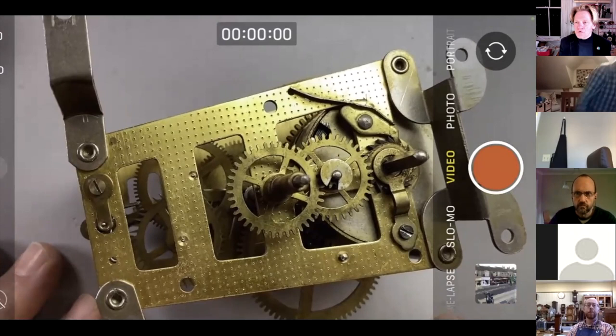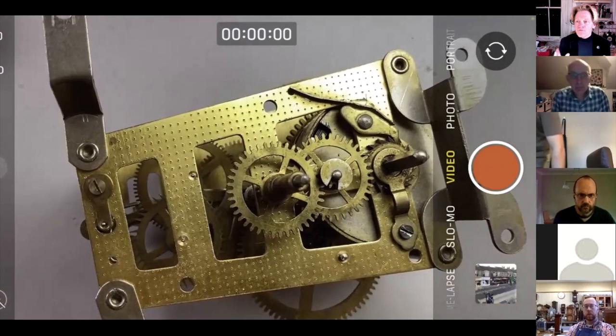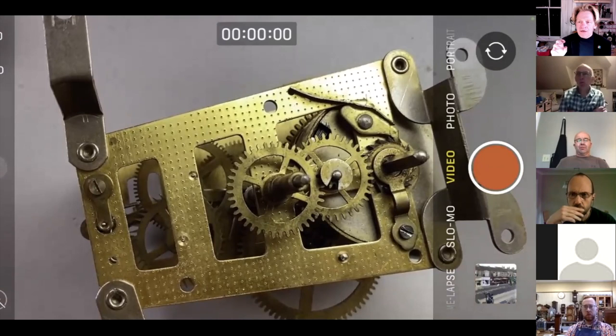Somebody talking about knurling. What's the perfect fit for that component? If we're talking about that wheel where we're colleting it, there has to be zero movement between the two, but you also don't want it to be tight. If we were doing that bush, the trick I just showed you probably isn't going to work, because it won't withstand the turning moment of the broaching. But I just threw that in there.